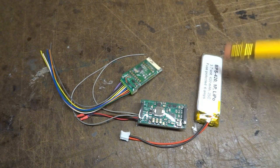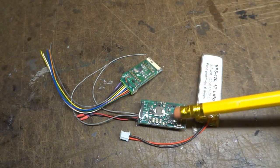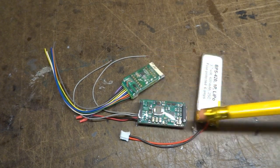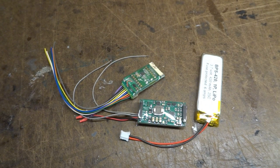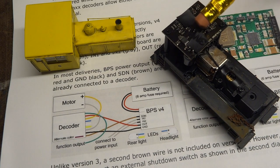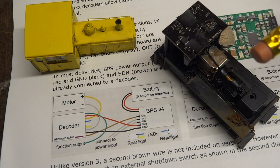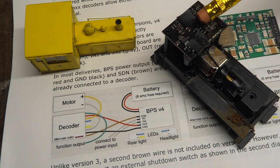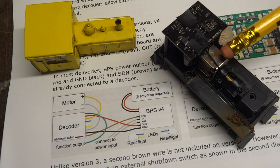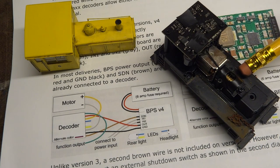The way these components arrive, the battery already has a connecting plug which will plug into the power supply and the NCE controller — all pre-wired and pre-attached. This whole system simply needs to be connected to the locomotive. Here's our circuit diagram for reference. Here's the little locomotive and I've already removed the cab and some other things. I need to take off the small circuit board on top — I don't need this controller anymore. The S-Cab comes with its own NCE-compatible controller. We are going to keep track of the two wires for the motor and the two wires for the power pickup on the track.